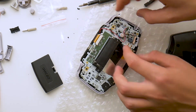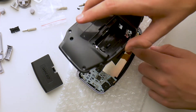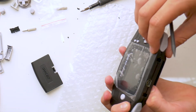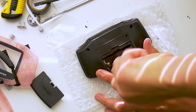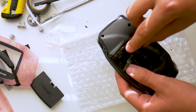After that, screw the motherboard back into place with the two Phillips screws. You'll notice the fit will be a lot tighter because of the added thickness of the display and the adapter cable, but don't worry — nothing should break because there's still enough clearance to squish it all together. Then take your tri-wing screws and screw back the back panel, and don't forget the small Phillips screw under the battery cover.